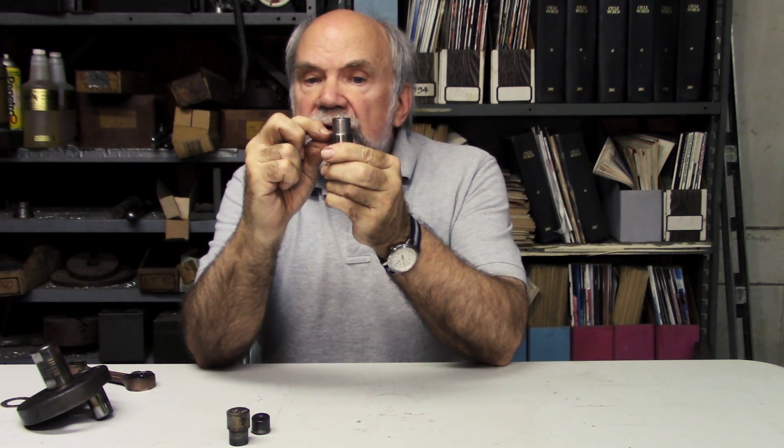This is one from an H-1R, as you can tell by the oil hole. Just as in the case of the breaking cylinder studs and the headless cylinder nuts, this is another case of a sudden change in cross-section bringing about a stress concentration at the point of transition, from which radiated all these little tooth cracks which you see here.